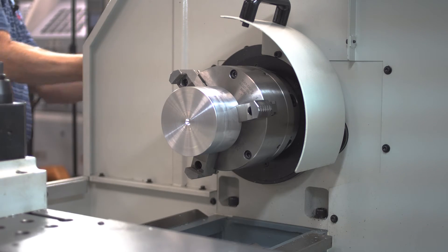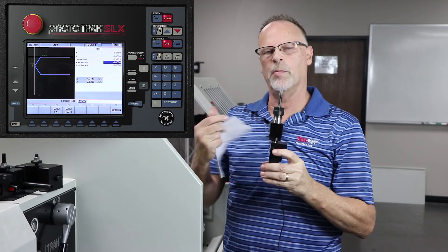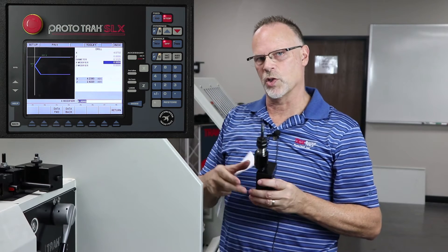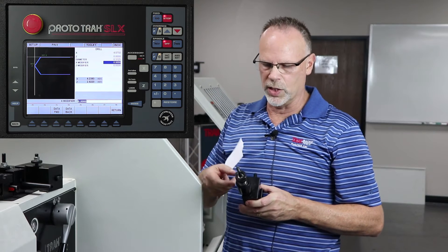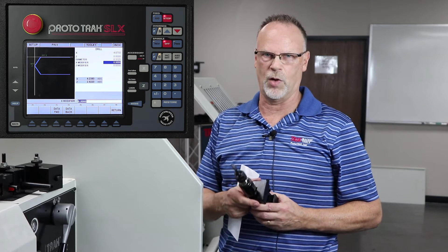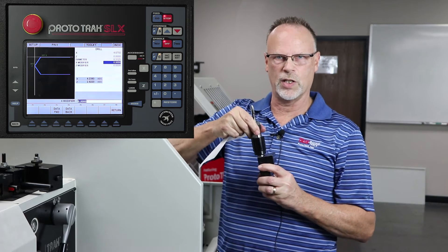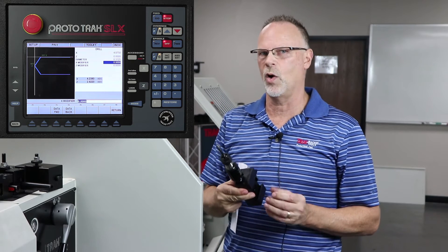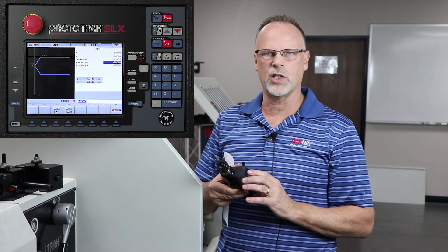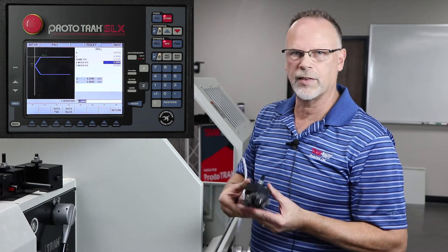Next tool I'm going to do is my tap, and the way that you set up the tap is exactly the same process. The only thing is I'm always careful when I put my tap in to make sure that one of the flutes is set up to be perpendicular to the diameter so that when they touch each other they're going to work right. In all Track machines other than an LPM or a 2WAP, we can't do actual rigid tapping. So what we use is a floating tapping head — it compresses and expands because we don't have an encoder on the spindle that knows exactly when we reverse direction. This allows it to compress until the thread takes place and then expand when it changes direction so you don't break your tap.